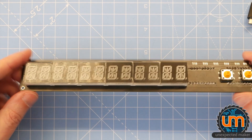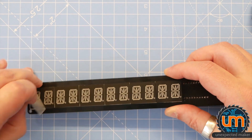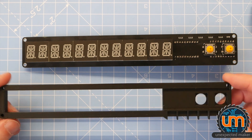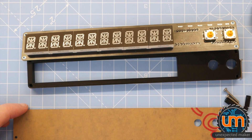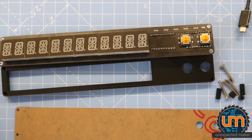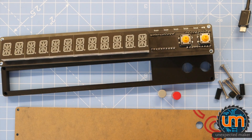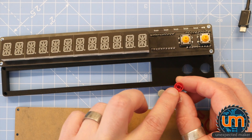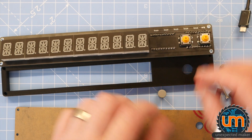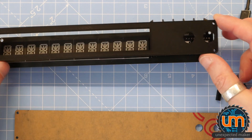So this is not the end. As cool as this looks, it's a bit unfinished. I've 3D printed something for the front that goes around the digits, and I've laser cut some acrylic for the front. I've got screws and standoffs, and these two button caps - unfortunately they're the wrong caps. The section at the back that connects onto the button is the wrong size, so I bought the wrong ones. I have new caps on the way from China. Once I put this together I don't know how I'm going to push the buttons, but I can put everything else together.